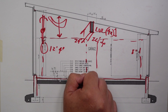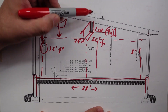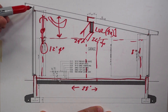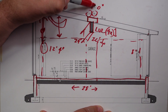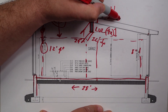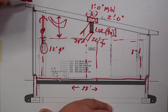So how do we do it? We have that big beam. It goes in and out of the drawing, front to back of the garage. We have our two bays that run parallel with that LVL beam. What I chose to do was bring our 2x12s up so that the one that comes off of the bottom — remember when we were out on the site — it runs long. And then the one that goes up to the top plate, well, it runs long in the other direction. And you can see here I have it called out as a one-foot minimum dimension on both sides, which centered on the beam gives me a two-foot dimension to then nail and spike those together to maintain some level of continuity across that beam. So then it would continue up to the top plate here.